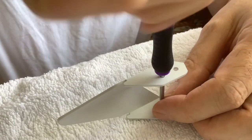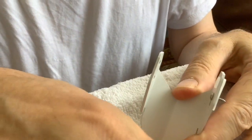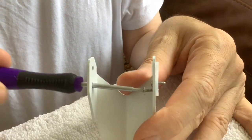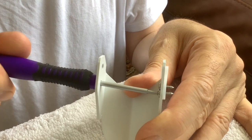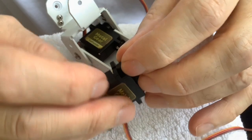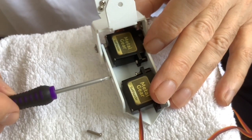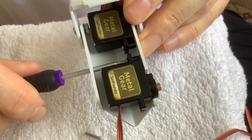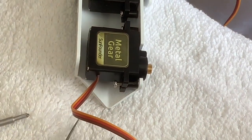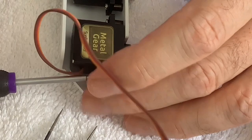This is the foot part — the bit that touches the floor. You're putting the servo arm on the foot part. You can see those screws are far too long; we're going to 3D print little caps for them just to cover them. Same procedure again: putting the servo in with its nylon spacers. The assembly didn't really go as slick as it might appear here — it's so fiddly, so tiny, the parts, and there's not much room to assemble.